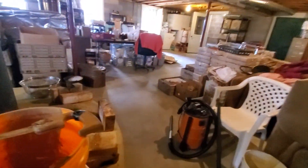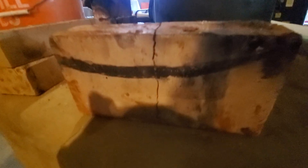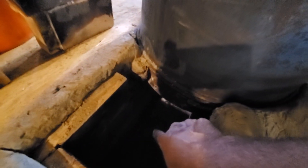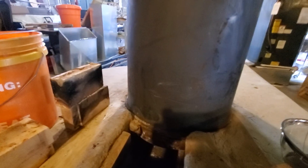We did have a couple of cracked bricks — three cracked bricks that I'm fixing, that we knew about last year. It got run too hot early on and cracked these fire bricks and took a big chunk out of the brick that goes right there. It just fell apart, you can see it right here. So we're cutting a couple of new bricks for the top of the burn tunnel.